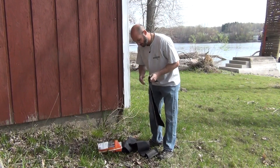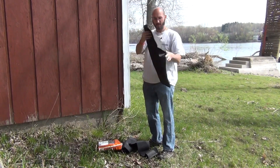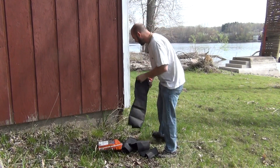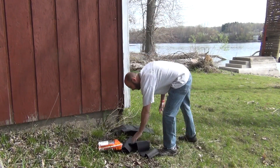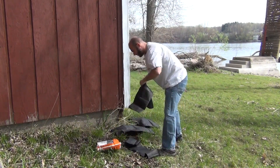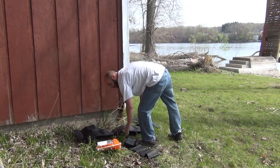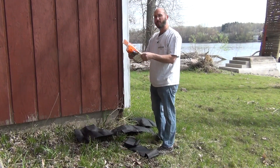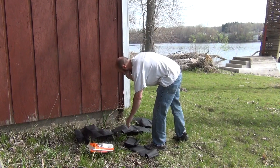Sandless sandbags, ready to use. Open it up, and you can see they're thin, they're lightweight, and they've got a gel inside. You just set them down in the area where the water is approaching and build your retaining wall. They are 12 by 24 by 3 inches, so they're going to go 3 inches tall.